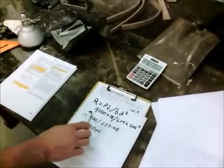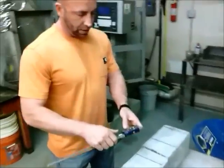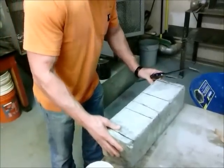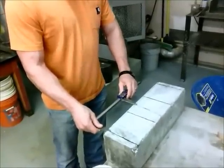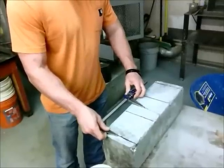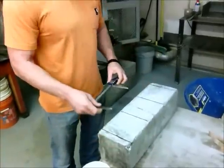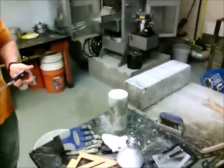One more thing you need to know is the distance of fracture from your first span length. Let's do six re-measurements. Put your block together and measure from this line to the fracture line: 8.40, measure here, 8.50 here, 8.23. Take the average of that and record it as well. And then you're done — we're breaking it in.